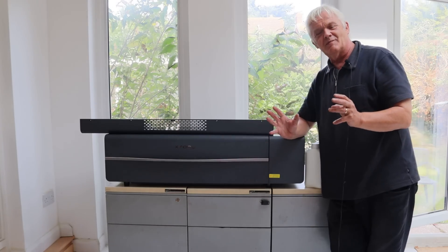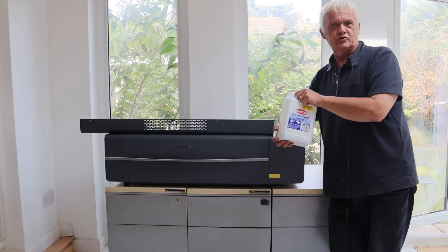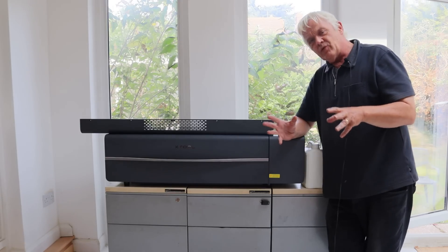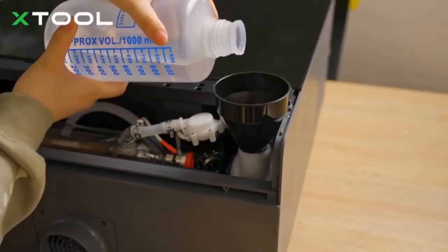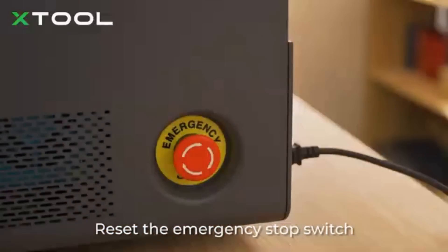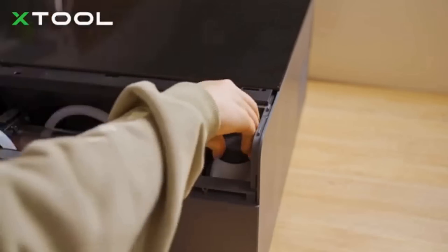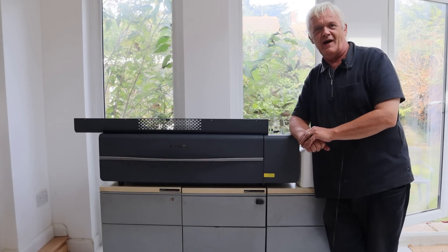The only truly essential thing to remember with the CO2 laser is don't forget to add the coolant. The coolant is nothing more than deionized water — the kind of stuff you put in household irons. They also supply some antifreeze that you add depending on a table of what temperatures you expect. I live in the south of the UK, so it never really drops below zero, but I'm going to do the minus ten to zero antifreeze mix. Once you've put the first lot in, turn the machine on, watch it slosh around, turn the machine off, and add the second batch to take it to its coolant level. Then you can put the back cover on. That bit is a bit of a faff, but you only have to do it once.